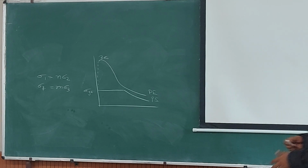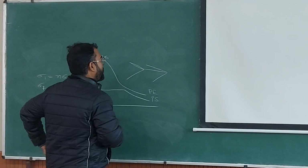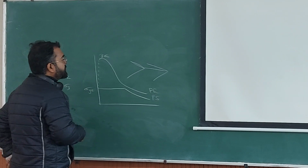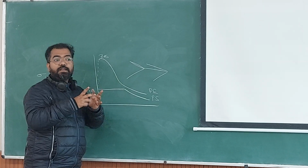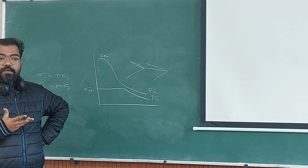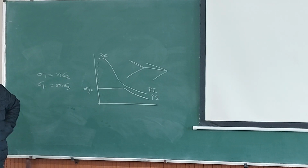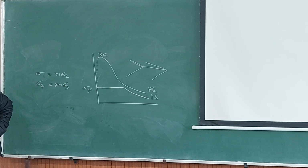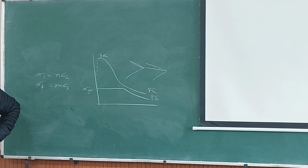Okay, so if at the tip you have stress conditions which are causing the material points to compress, there is a form of pressure on the tip, then you need to apply more stress to open the crack. Okay, because a part of the stress is acting to compress it, and this is a function of geometry. This will happen if you change the temperature, but if everything is fixed, then for different geometries you will get different values of T stresses.